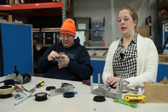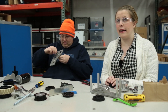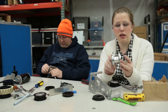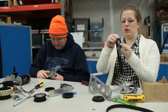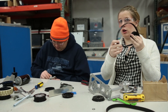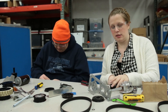We're currently working on the gearbox to intake the rope into the robot so we can accomplish climbing. This gearbox did have a metal smooth intake to turn, but we took that out. We're going to use a belt similar to this to turn and intake the rope onto the robot better and be able to lift the robot. Right now I'm just switching out the two systems.